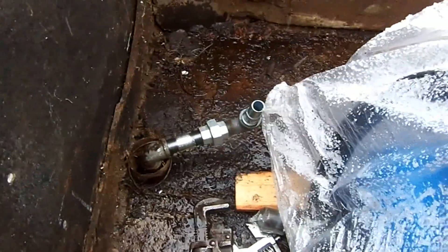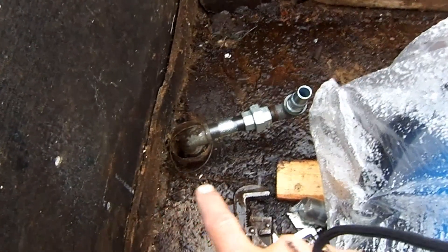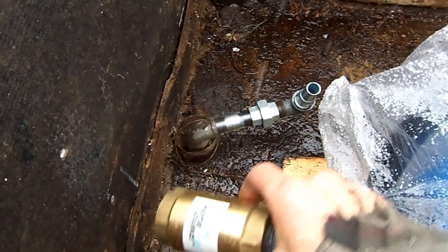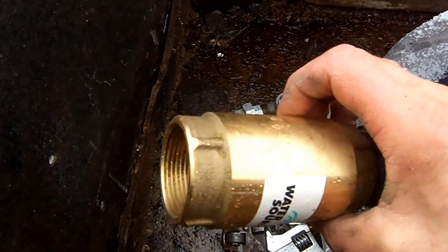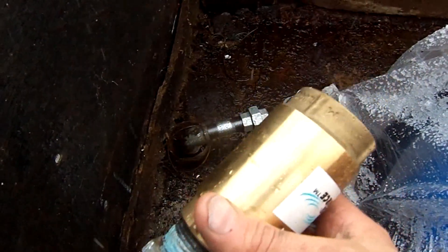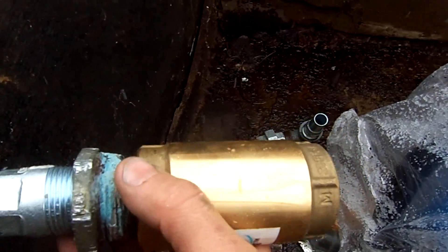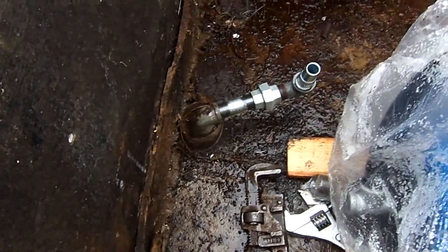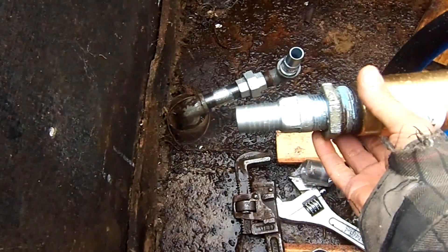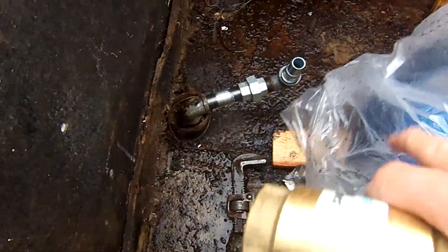This morning when I checked my previous arrangement, I'd lost prime in the pump, which means the foot valve on the bottom of the pipe is probably going bad. So I'm going to do this right and get a check valve on this. If you can, and you've got the space and the time, it's always a good idea to get the check valve on the inlet of the pump — then you never have to worry about the foot valve on the bottom. It's a good habit to get into.